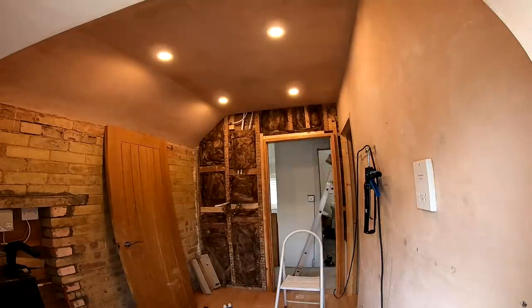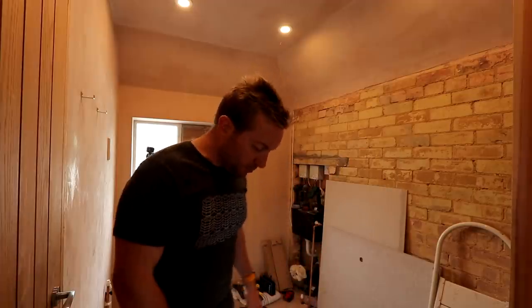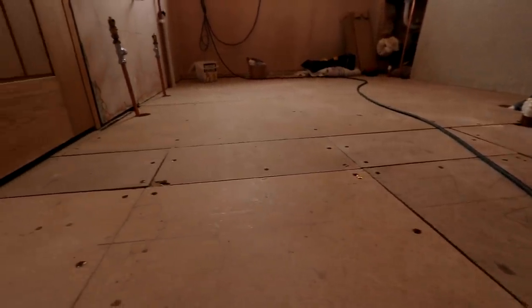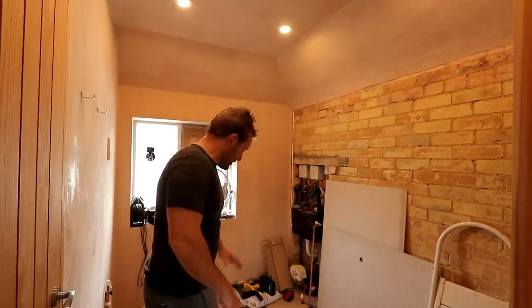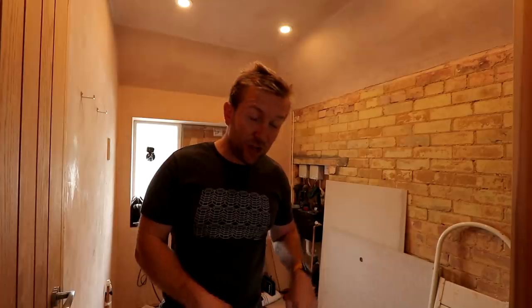The next job I'm going to do is ply this floor. Normally people would ply this in quite thin ply, but I'm going to do this in about 9mm. The reason for that is we've got a few bits of the floor section that are going to be a little iffy. If I want to tile this, I want to make sure the floor is very very level and very well fixed. We're going to have two huge sections of ply, and I might even be able to get this in one big section with just a little slither down there. This is important work because it means hopefully our tiles will stay nice and stable when it's all done, and also this will keep water away from the chipboard — if we get any water on that it's going to blow straight away.